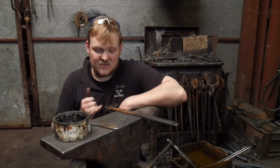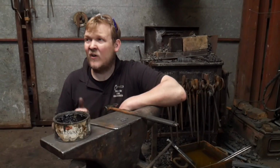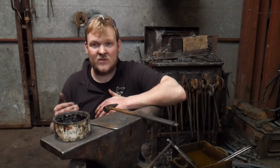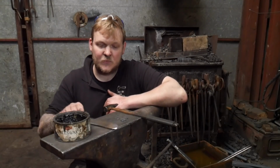This is nothing special, no special steel, this is 4140, it's made of forklift truck tine. I just find that as you get more confident with it, you know how to drive it in and you have less problems. However, these punches don't last long, it only takes one mistake. You'll have to grind a bit back and then, yeah, they don't last long at all.